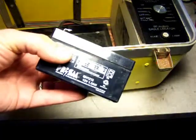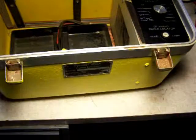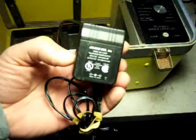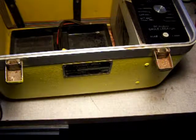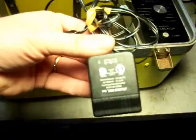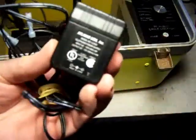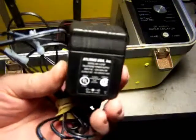And they're very cheap — ten dollars a piece. You can buy them at Mouser or Digi-Key. When your 26 hours are up, you take a wall wart — these little wall transformers, 12 volts. This one here is a 200 milliamp 12-volt power supply, and you can use this to recharge your batteries. Simply plug it in and put some fastons on it. Plug it in for a couple hours and you get yourself a fresh battery for ten bucks. You don't want to go much above 200 milliamps — 500 milliamps may be okay — but you don't want to charge these things too fast.